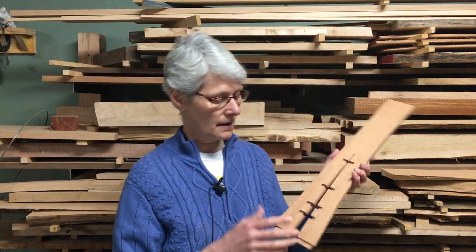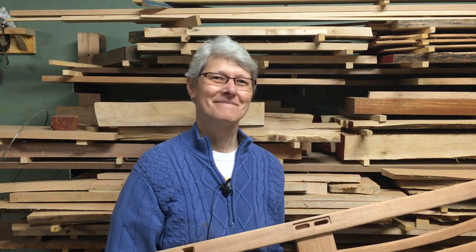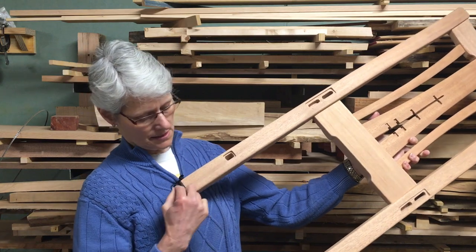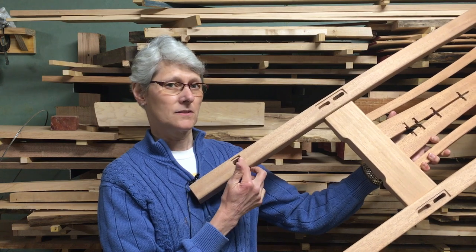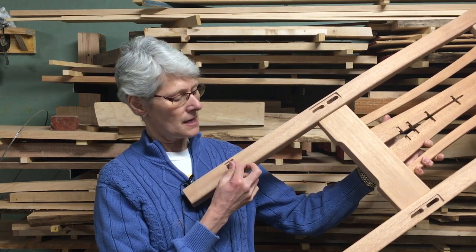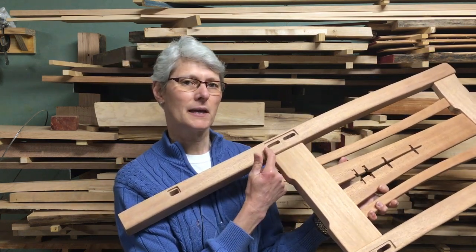The full length of the back splat — the open space you're going to see between the joinery — is a full 16 units. On the bottoms of our legs, the distance from the floor to the top of the cross bars is five and a half units. From the top of the cross bars to the bottom of the rails, which is our negative space, that's nine units. While all chairs have basic components that are the same, the overall design of the chair needs to be in harmony with the sum of the parts to create an aesthetically pleasing look. Fibonacci is cool!